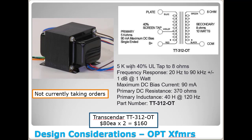This thing has 5K with a full 40% ultralinear tap into 8 ohms, 20 hertz to 90 kilohertz, pretty good ratings here. It'll tell you this thing will handle up to 90 milliamps. Well, remember, we said we're only going to be running about 50 to 55, maybe 60 at the most through this thing. Even on peaks, I doubt we would hit 90. It tells you the DC primary resistance of the windings in this thing and the primary inductance. But you kind of get the gist here. Nice little stout transformers. And I actually own a pair of these. I'll show them to you later, probably in the next video.